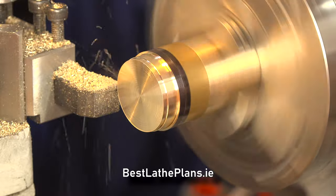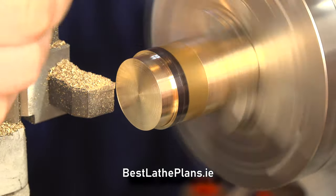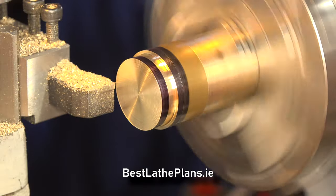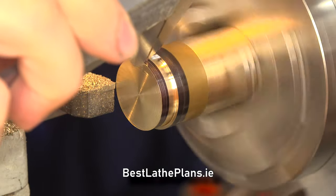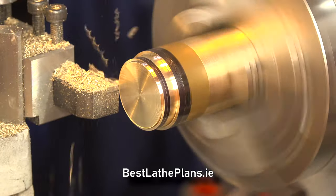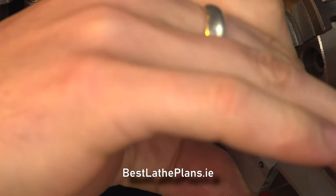After a few more cuts we're now at the outer diameter. Next up is the step cut to fit the oil can body. I'm marking the depth of this cut with a Sharpie and verniers and quickly checking the rough diameter, then reducing the diameter of the step.